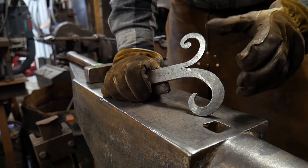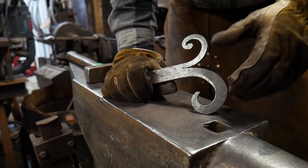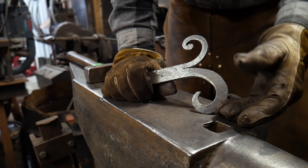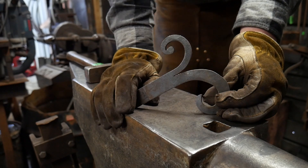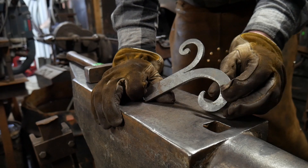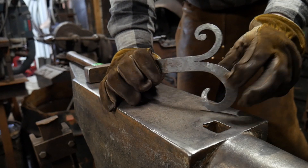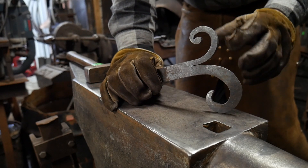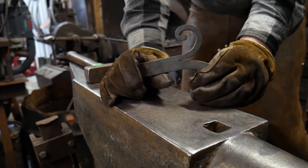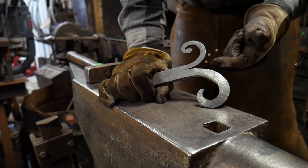If we applied the same logic — that that is now a stress factor on an old wrought iron hinge — we'd have big problems, right? A big heavy thousand-pound church door falls, kills somebody, and they go get even with the blacksmith. Not a good deal. But we are working with modern steels, and again, this is an end detail. Anything that's non-load-bearing and simply ornamental does not have to have any sort of extra preparation at the end of the saw cut.